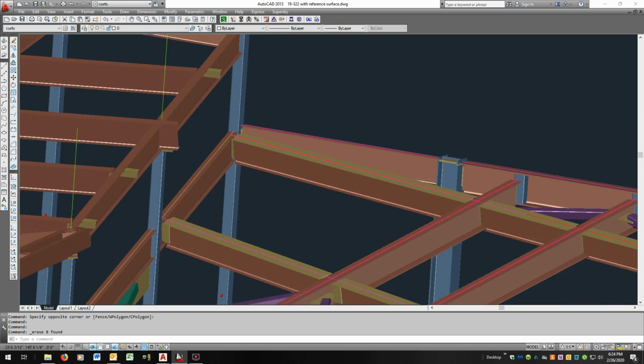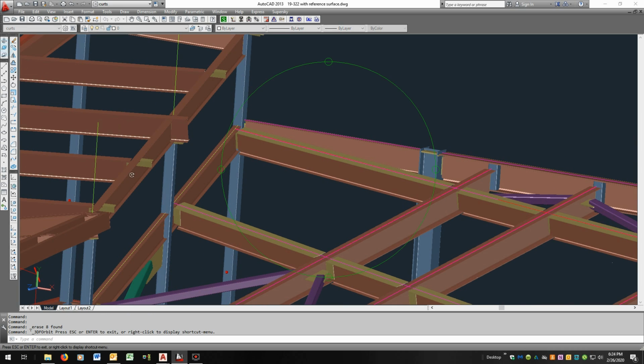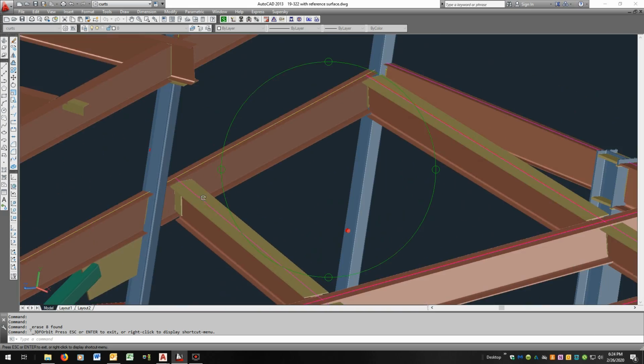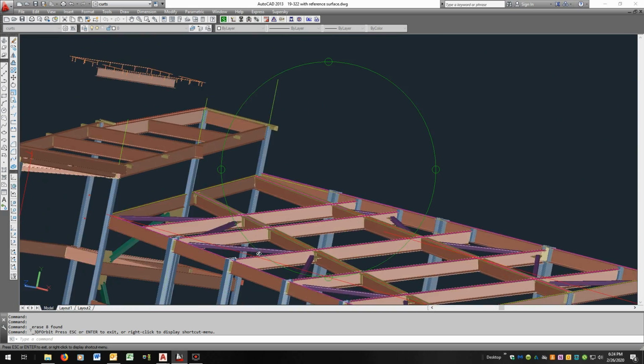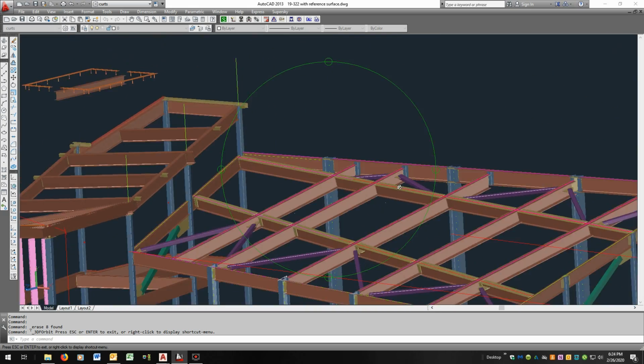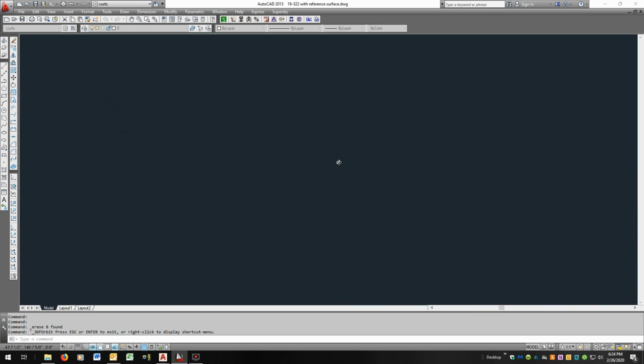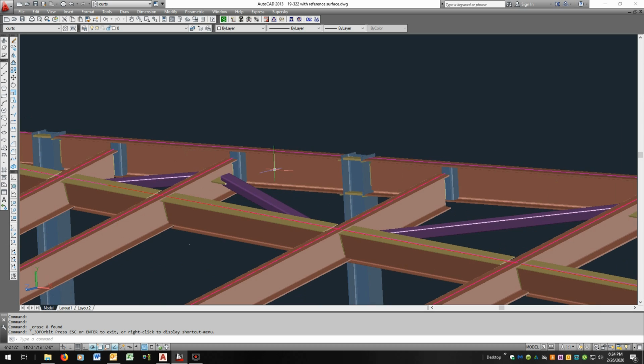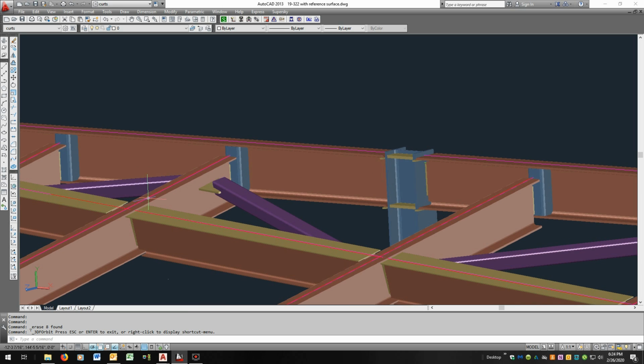These look like they're working out for connections. This one I think will be okay. And that leaves us just the tube at the very top. Right now it's 2 inches above the slope. I think it needs to be pushed down 2 inches to elevation 140 foot 5 inches. That will let us bring the same skylight frame over the top so we can connect here.